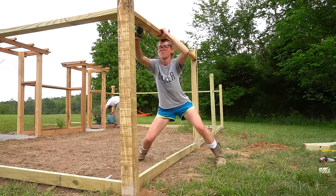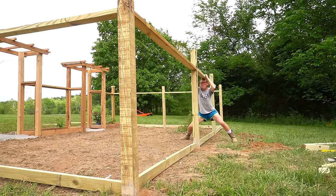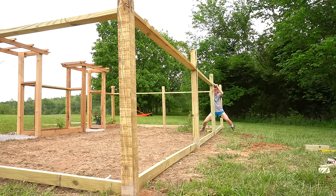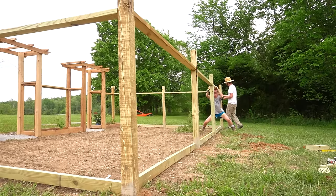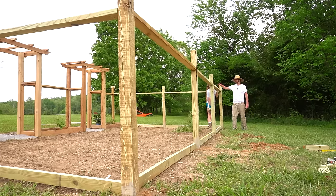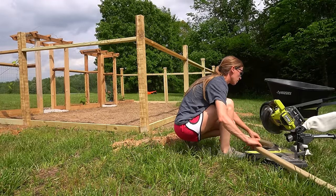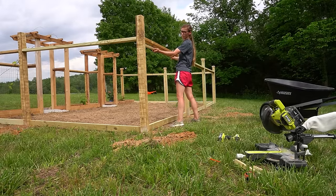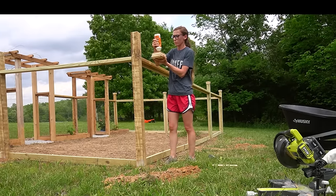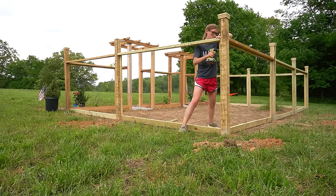It would be nice to have an extra set of hands for these top pieces, but I found my head a helpful resource in a pinch. Danny did offer to help, but I knew he was working on his own projects and I could manage alone — though he did help me on the very last piece. Teamwork makes the dream work. Once all the 2x4s were up, I lined the sides and the top of each open section again with 2x2s cut to fit, secured using 2.5-inch decking screws. At some point I got distracted and glued on the fence caps, then came back to finishing the 2x2s — sometimes it's just good to switch gears.